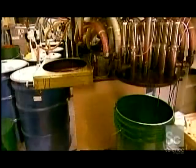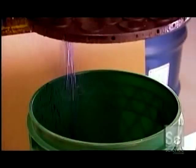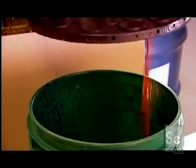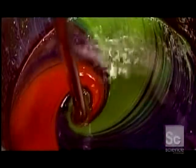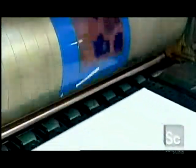The printing of the boxes began in the factory's ink kitchen. A computer-guided dispenser squirts out different shades of ink, following a precise recipe to create a particular color — one of 5,000 in the palette. One pail holds about 45 pounds of printing ink, enough for 2,000 boxes depending on the coverage needed. The factory uses water-based ink because it dries instantly. The printing press applies the ink to the boards, one color group at a time, through four consecutive stations.